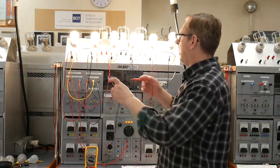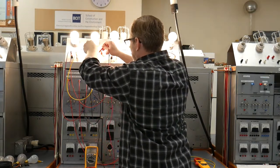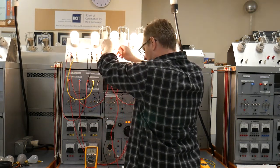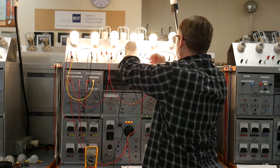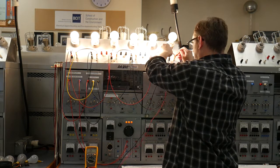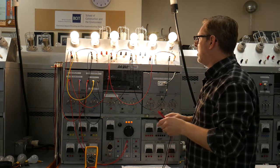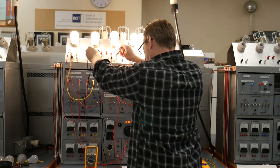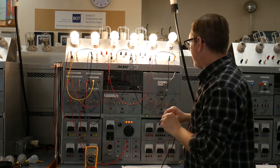Okay, we'll power that up. Now we're going to verify. We should still have our 107 there, which we do. This one's 107 here. This one here should be the 108. This one will be the 133 or 135. There we go. This one here previously was the 135, which it is, and there we got the 79. So across J2 we should see the 28 volts-ish, which actually we're down a little bit, at about 26 volts. But here we should see around 55 volts.